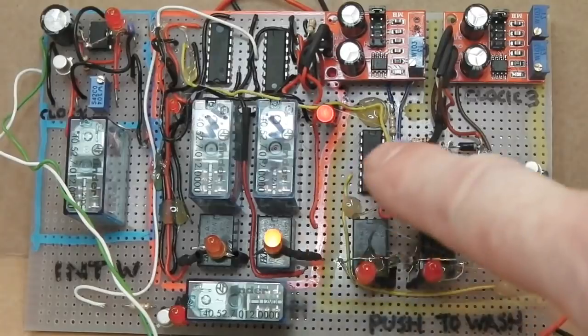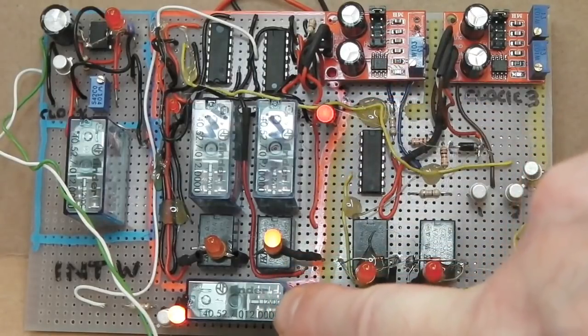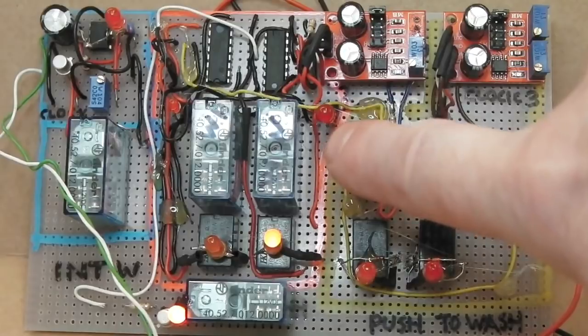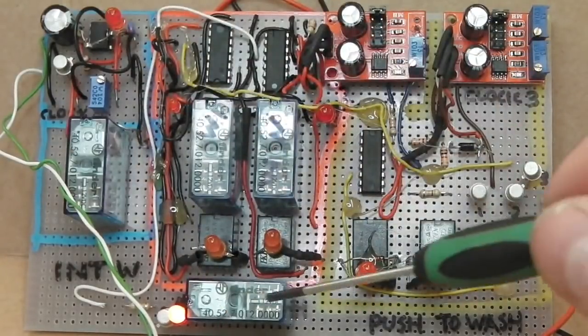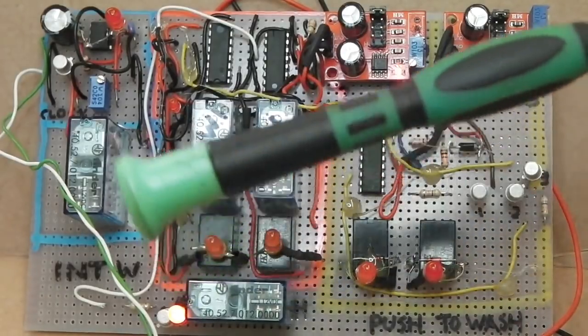So we now arm. There's our first squirt of water. Auto sensors armed, second squirt of water. Wait now. Off for the water, so wipers, everything's idle, nothing's happening. We're going to look for this post wipe, done. That's the end of it. Circuit disarms now, it's completely idle. However, what does stay on is the rain sensing wiper. It is now armed until I turn off the ignition, or I can put the stalk up in the middle.